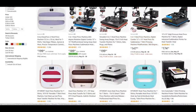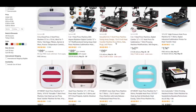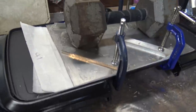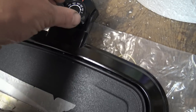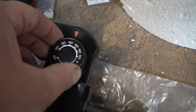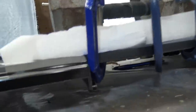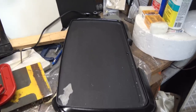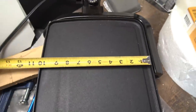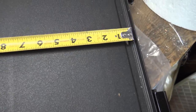I've been looking for an alternative method, and one came from Odd Prints on my community Discord — he had been laminating plastic into microfiber cloth using a T-shirt press. A T-shirt heat press is nothing more than a flat surface that heats to a specified temperature and clamps the fabric to adhere films and dyes. I didn't want to spend money on something that might not work, so I went a cheaper route: a $25 electric griddle from Walmart with a smooth surface, about 10 inches wide by 20 inches long — plenty of room to laminate a SAPI plate — and a nice temperature dial.